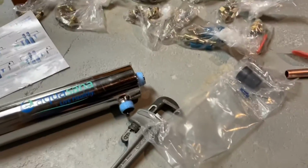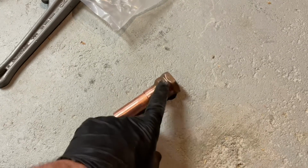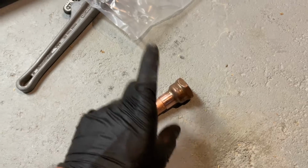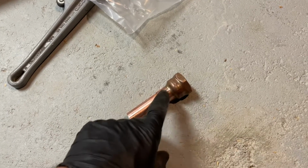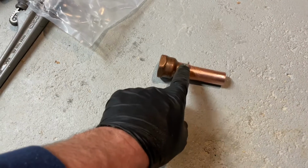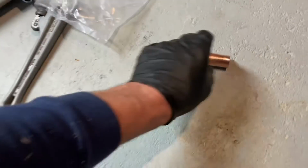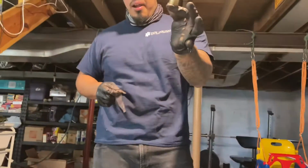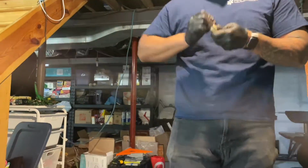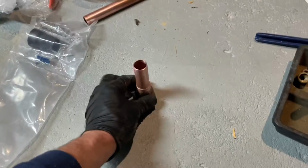And I have to go back to 3/4. So I have a 1-inch by, let me get this fitting right. I have a 3/4 by 1-inch copper by female adapter. That's technically what it's called. The copper's first. So 3/4 by 1-inch copper by female adapter. Steven is cleaning the inside of that, right? Mm-hmm. Okay. And that is gonna go there.